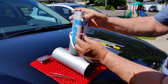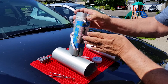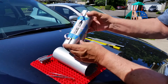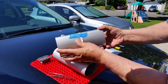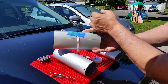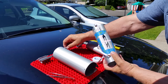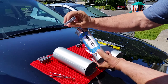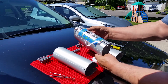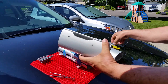The feed slot width is smaller than the inside channel. It's very easy to make a gate that'll snap in when the outside width is the same as the inside — then you need to cut a groove inside to where I make a gate that has a side barb that'll go in and snap into it.